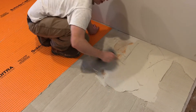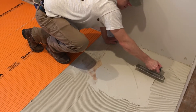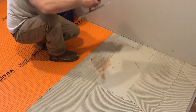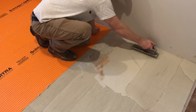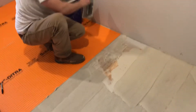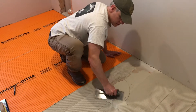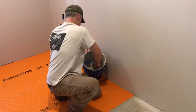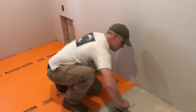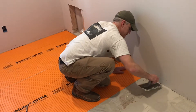The DITRA really is nice — it just gives you an extra layer there to protect your tile from breaking. It's called an uncoupling membrane, so it uncouples the tile from the subfloor and allows the subfloor and the tile to move independently in case the humidity and temperature changes. You're always going to get expansion and contraction, and with a wood subfloor it always expands and contracts at a different rate than the tile. When that happens over 30 years it starts popping your tiles loose — first the grout joints start to break and then all of a sudden your tile starts popping loose, and then it just goes downhill from there.